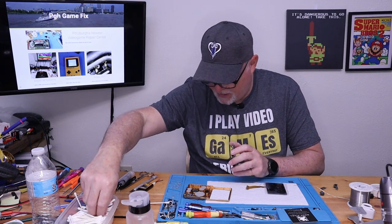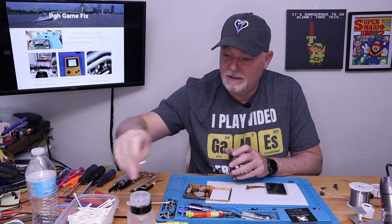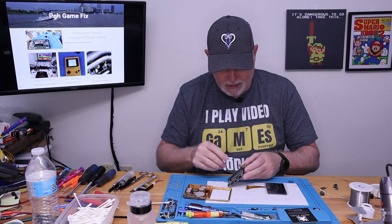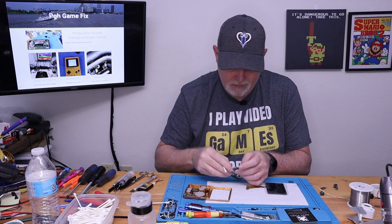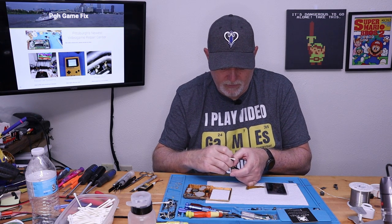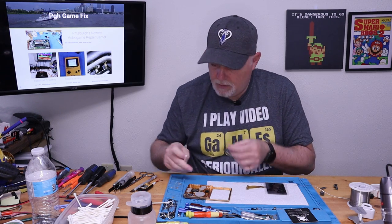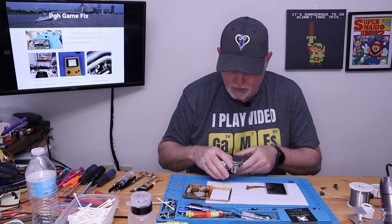And you've seen me do this in my other videos. Sorry, I can't wear those all the time, just when I'm looking at the small stuff. So just get a little alcohol down inside the switch. Hold the top, run it back and forth, just to make sure you polish it. That should be fine. All right, so let's go back to our screen.